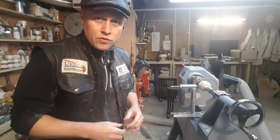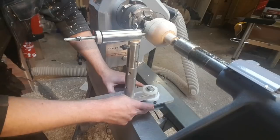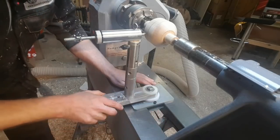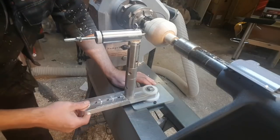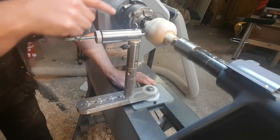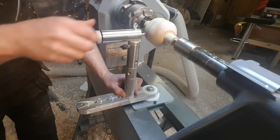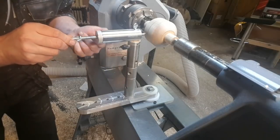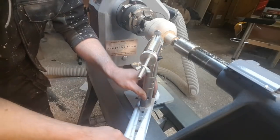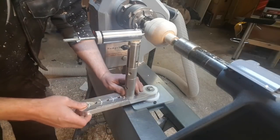I'll move the camera around, and I'll talk you through the various bits on it. So here's the jig. It's mounted in between the bed bars with a disc that I turned to make sure that it fits absolutely centrally. There's a really sturdy distancing bar, and nicely marked distance markers for however big the sphere I want to turn will be. And it's got some risers here, which bring it up to absolutely bang-on centre of the lathe, and a quill that moves in and out with a locking nut as well. And the whole lot swings really easily over the top of this nylon washer down there. And that's it.